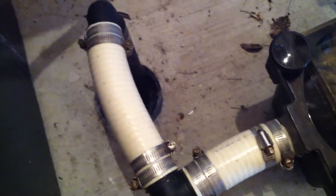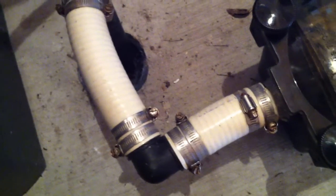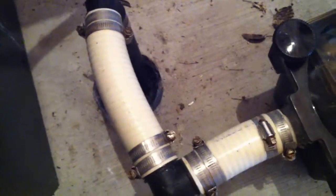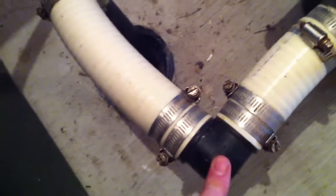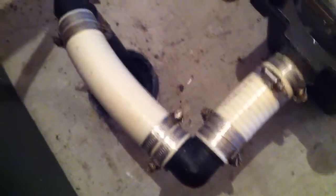The first thing I see is flexible PVC clamped in place. Flexible PVC is made for glue and primer applications — it's technically rated as hose and not pipe. It shouldn't be used with a barb fitting and clamp; that's for use with poly-style pipe. Does it work? It's okay, but is it likely to hold 30 or 50 PSI if you were to pressure test this system? Probably not. Technically a deficiency nonetheless.